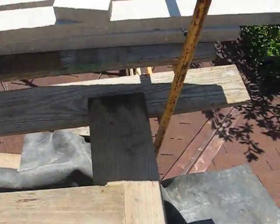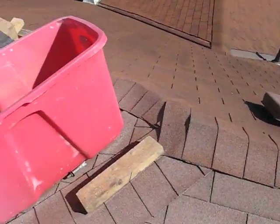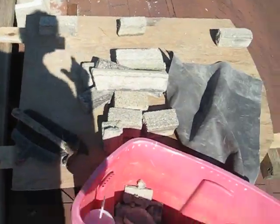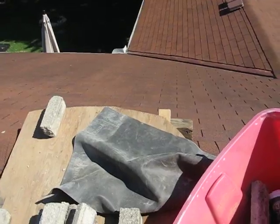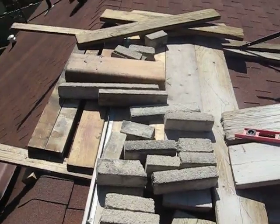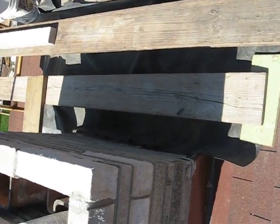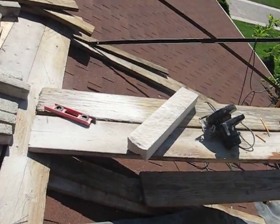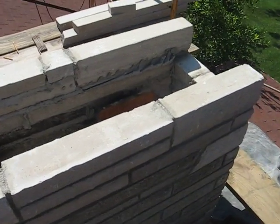There's a lot of equipment and material that goes in on these jobs. As you can see, we got all the scaffold up here on this roof. None of this is actually nailed into the roof. Most of these jobs I got some techniques that allow us not to do that. Basically we hang it off the peak of the roof. It's all hanging scaffold. None of that stuff actually touches the roof. And then we'll always run rubber roofing around the chimney areas. That helps protect against saw cutting, since there is definitely a lot of saw cutting of the stone in this particular job.